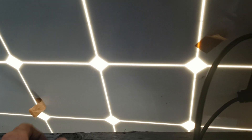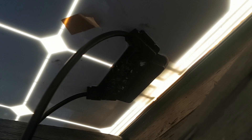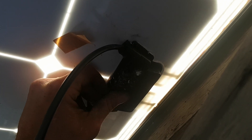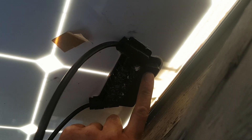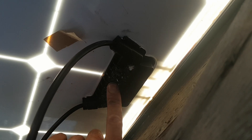So what did I do? I fried all the diodes in my solar panels. Because I had a bunch of these panels in series, they just completely shorted out. I looked in the junction box but the diode was not in there — it was right in this unremovable plastic.